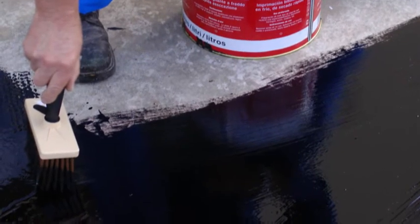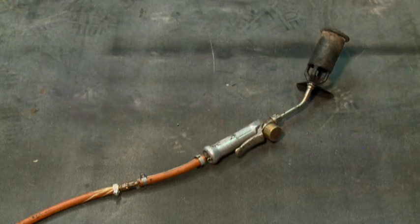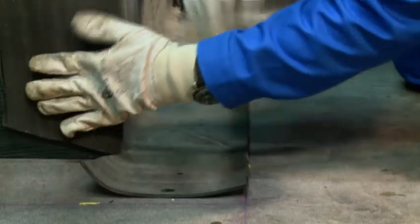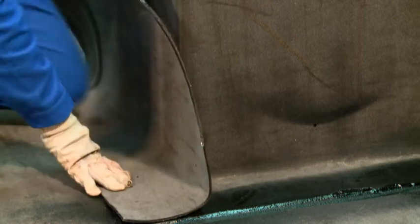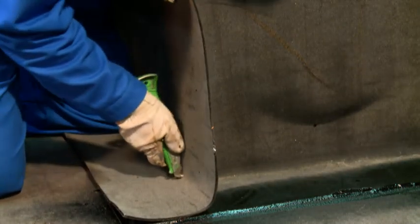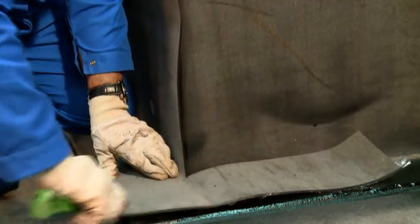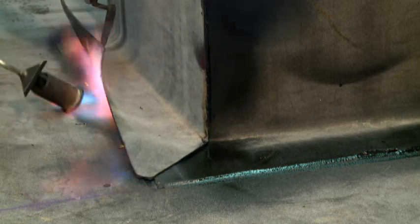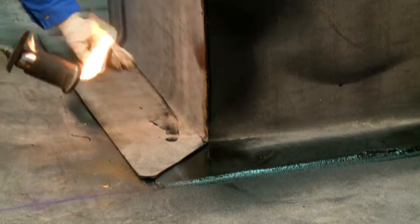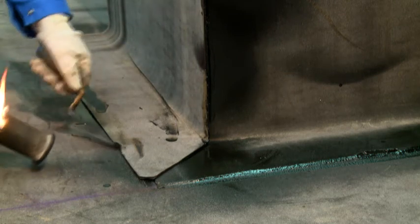The concrete surface of the upstands should be primed with a bitumen primer, preferably Cyplast primer supplied by Cyplast. For detailing and intricate areas, a smaller torch of 45 mm is easier to use. Cut the strip so that the membrane can be placed in the corner. When fixed, the horizontal section should be at least 15 cm from the upstand. Start by welding the vertical and then move on to the horizontal. Finish the details by ironing out with a trowel, ensuring that the underfacing film is melted for subsequent fusing of the surfaces.